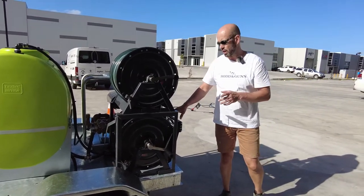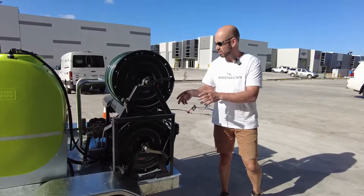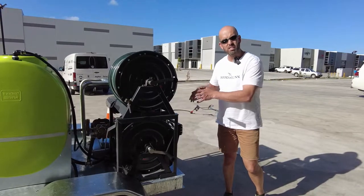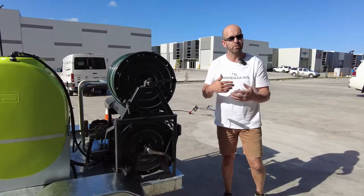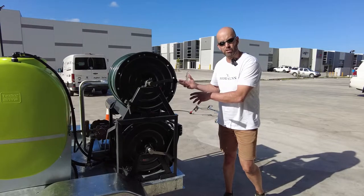We've got 60 metres of pressure hose — you'd be able to double that up on a bad day if you needed to run 100 metres. But the beast is 5000 PSI at 21 litres a minute, so that's maxed out. If you needed to reduce that pressure, dropping the RPM will reduce that pressure and reduce that flow, or we could jet it accordingly to change the pressure.